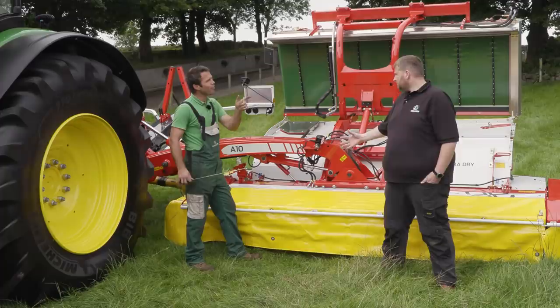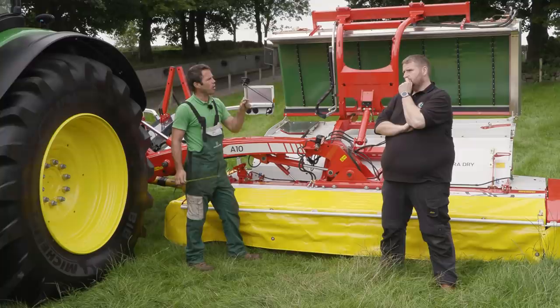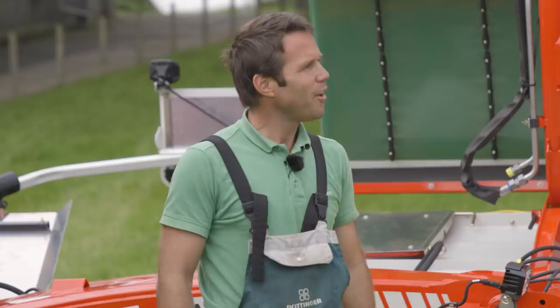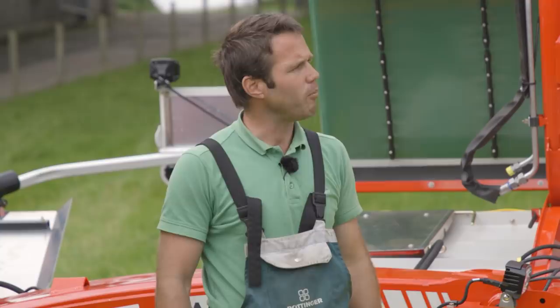But a step further before you go, unique with a tractor similar to this spec, you can automate it on the work screen. You press an auto button and she'll follow the turning angle of the front axle of the tractor. So when you're turning right, she'll steer the mowers in that direction to stop any misses. So that's your back mowers, two belts, the back of the tractor.